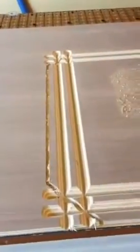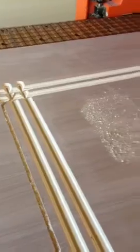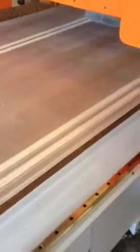That 45-degree cut is putting the 45s on that inch and a half return that's going to be parallel with the top. So all those two parts fold over, and then there's the 45-degree joint that's going to make up that inch and a half return. It's going to continue around.